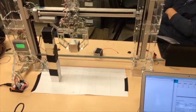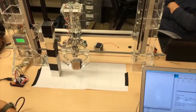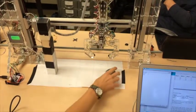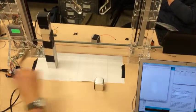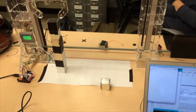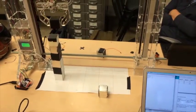In order to determine weight, the Skyclaw first clamps onto the block at full force. After hovering over the heavy stack drop location, it will release the block slightly. This is enough to drop a large block, but not enough to drop a very light block. If it is a light block, it will reclamp onto the block and then move over to the light category.